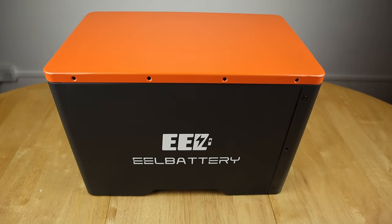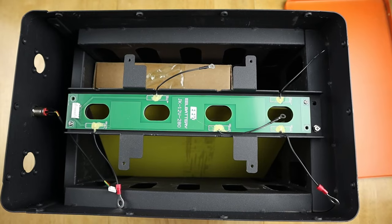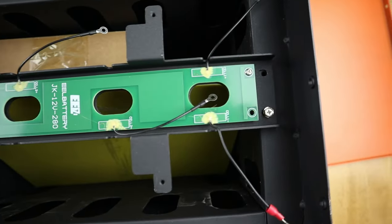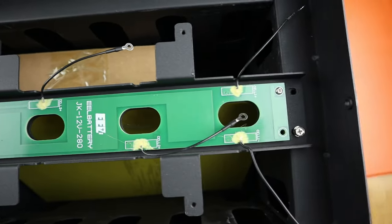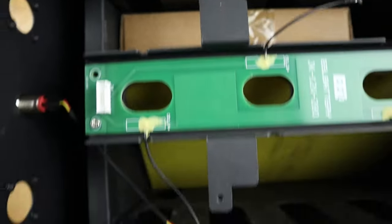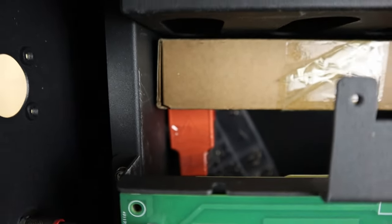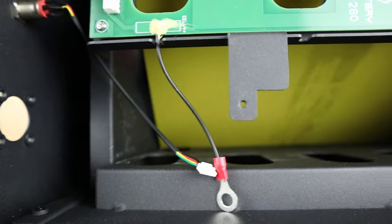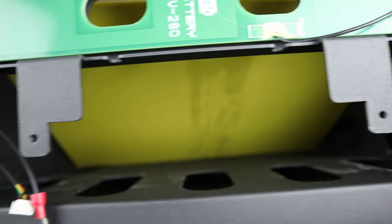For the overall price — which I'll share later in the video — this will effectively be a 280 amp-hour 12-volt battery, giving me around three and a half kilowatt-hours of raw storage. There are some losses in there so you might not get all of that. Let's whip the lid off and see what's inside. You can see a similar crossbar that goes above the cells once they're mounted, similar to the 48-volt battery boxes I've built.